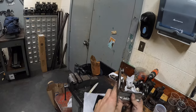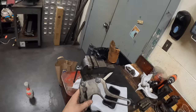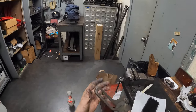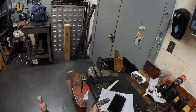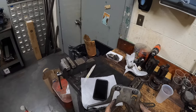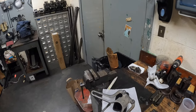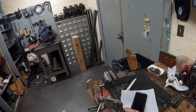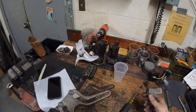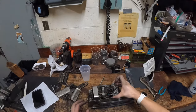Just like that, that one's pretty good. I have seen them where if the table comes down and lands on a pin the wrong way, these little overhangs get all bent up. You can try to straighten them out - usually you get lucky - but sometimes they get squished together right here causing the roller to bind up. I take a flathead screwdriver and pry it apart. You'll know when you get it because the roller should go through there nice and free.